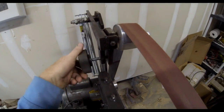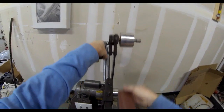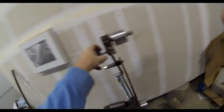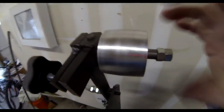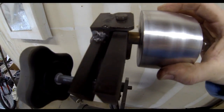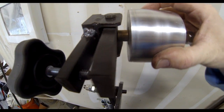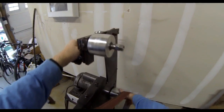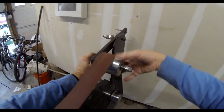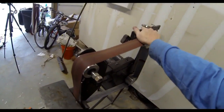This is the wobble bearing or tension arm adjustment, and that allows you to adjust the belt to the left or to the right just with a screw. We basically took a half-inch piece of steel, drilled and tapped a hole in it for the stud and the aluminum wheel, then drilled and tapped through the side of that steel for little shoulder bolts that it pivots on — creating our own fairly easy-to-make little wobble bearing.